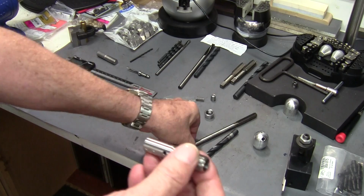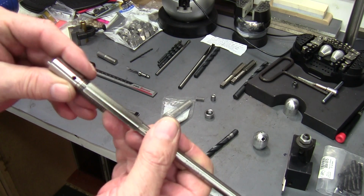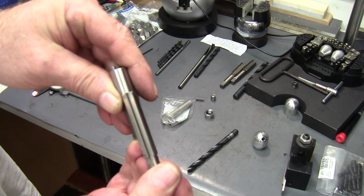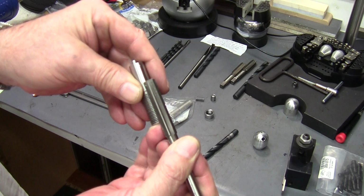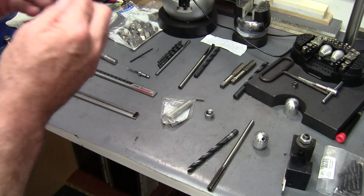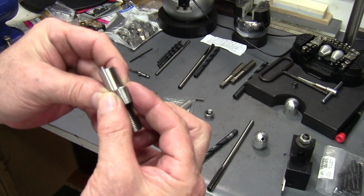Now when I drill or ream, or both, this 0.375 to 0.350, whatever you decide to use, when I ream that out, I want that reamer to go right to the bottom of that hole. That's where I want it. That's as deep as I want it. And the dimensions are on the blueprints. Because if it goes past that hole, your piston can go past the vent holes. And if that piston totally covers that vent hole, it'll hang up.